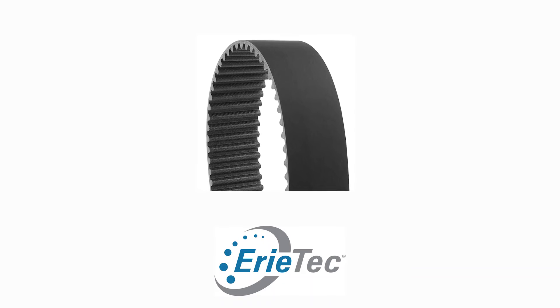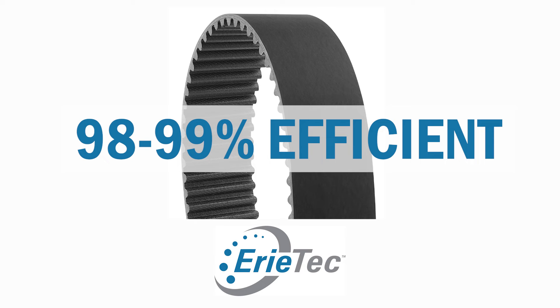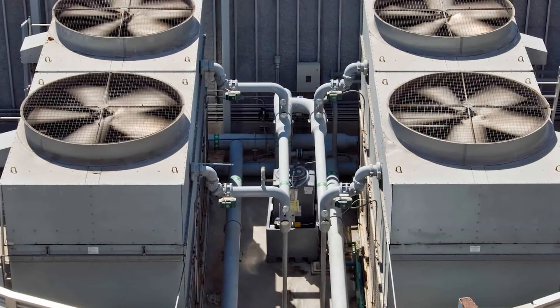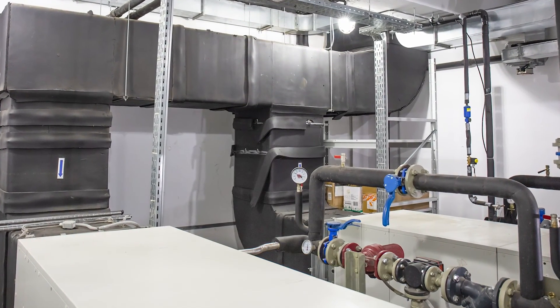Now there is a way to increase efficiencies even more — that would be to use synchronous belts or timing belts on your application. Synchronous belts run approximately 98 to 99% efficient. These are not a cure-all for every application. They must be properly tensioned and aligned, even more so than V-belts, and they need a solid base. They're best connected to a motor run off a soft start or a VFD because there's no slip in the system, although many are run off motors started across the line. They should not be used where there's heavy shock load. There are hundreds of thousands of synchronous belts in use today — don't let that scare you away from them. In many applications such as HVAC where you have solid mounting and are using VFDs or soft starts, synchronous belts are a fantastic option.